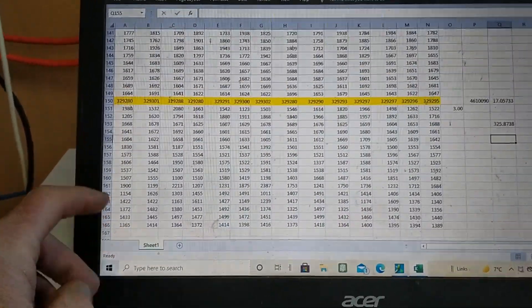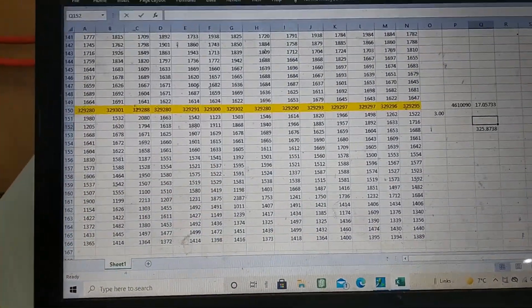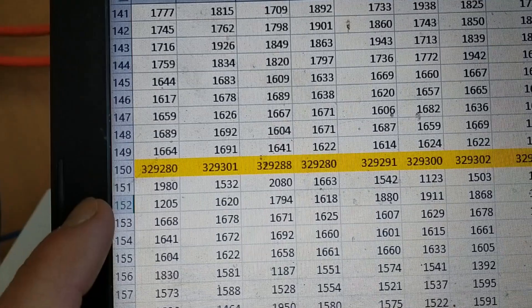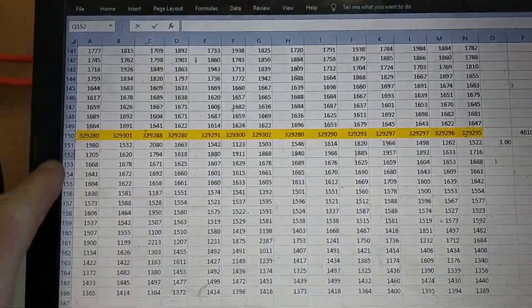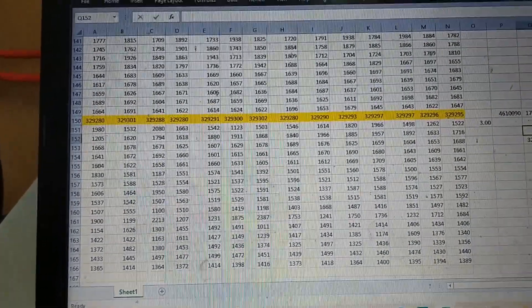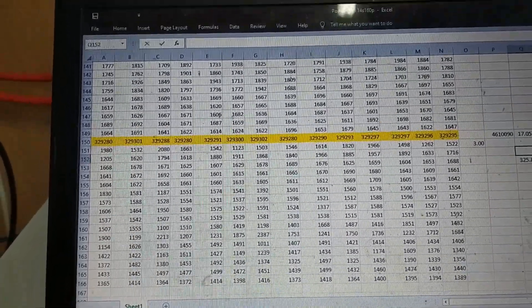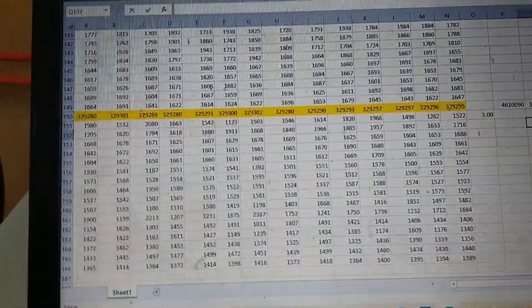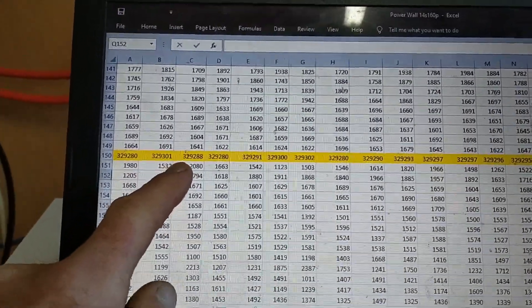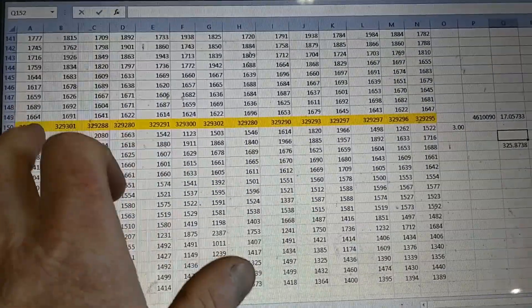As I go down and fill up my battery packs, I put here a total milliamp amount per each pack. Bank one: 329,280 milliamps. I do that to keep note of which is the highest and which is the lowest. As I get close to the end, keep aside the highest or lowest cells. When you've put in a row and a pack is still the lowest, you put in a high cell — all you're doing is trying to keep the spread between the highest and lowest pack as close together as possible.